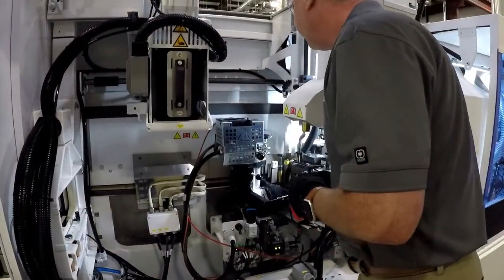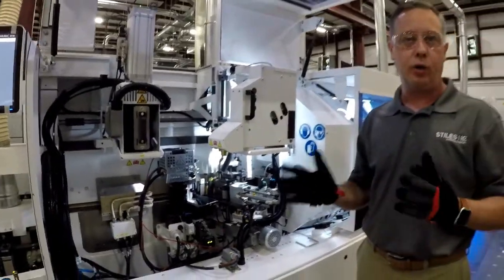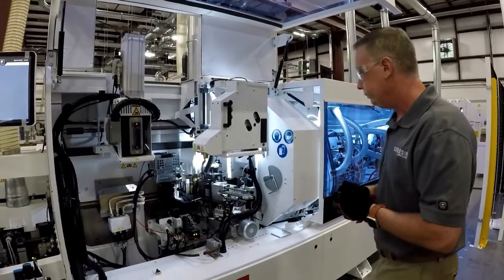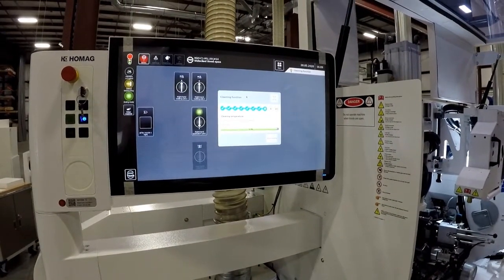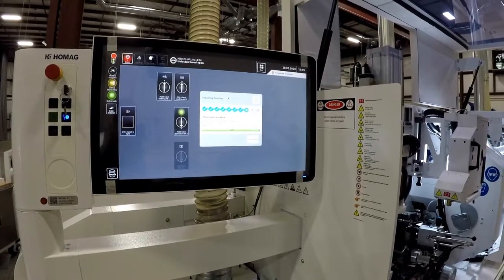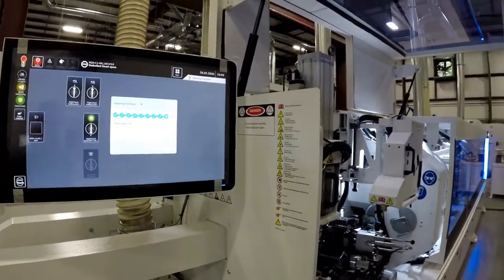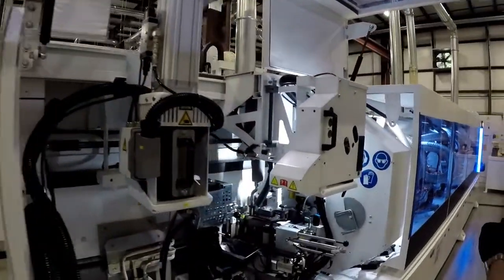As we're letting this heat up, it should begin soon. The whole process takes about 20 minutes from start to finish to fully purge and clean it. We're at almost 100%, bringing the temperature back up to get all the cleaning granulates melted. When we hit 100%, we should see the gates open back up and the cleaning agents start to wash it all out.